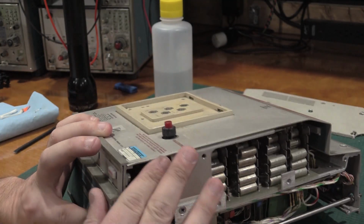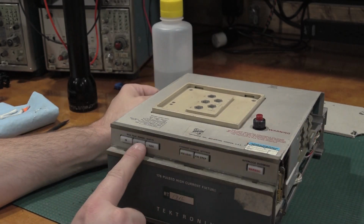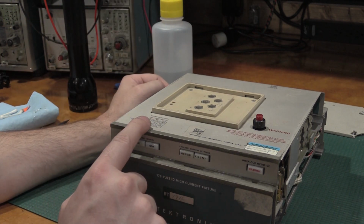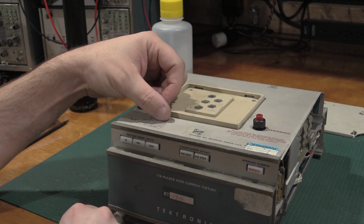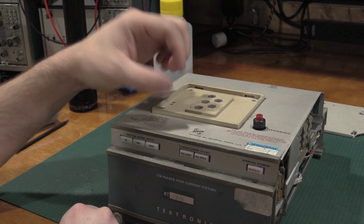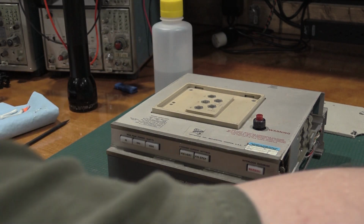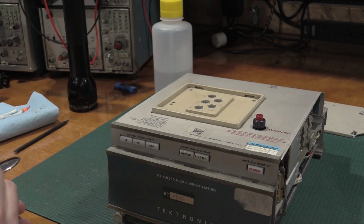Okay, that makes more sense. I was trying to figure out. You tell it what you want the max peak power to be, and this chart tells you what the series resistance is. So like on the 15 volt rail, if you select 1,000 watts, you get 61 milliohms of resistance through the test fixture, or the series resistor is 61 milliohms.